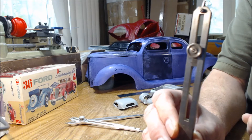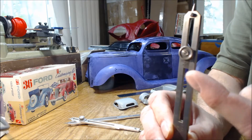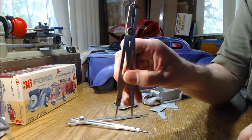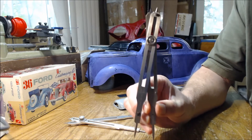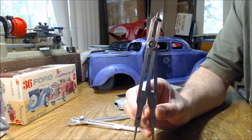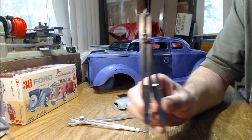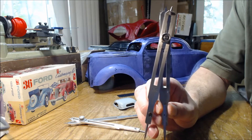The numbers on the lines and side represent a direct proportion, so if you pick two, you're doing a proportion of two to one — one inch becomes two inches, three inches becomes one inch times three, and so forth. It's really quite simple. There are instructions for making these out of wood on the internet. If you have a set proportion you know you're going to constantly use, you can even make one out of pieces of aluminum if you trust your skills — you don't have to spend 20 to 200 bucks on it.